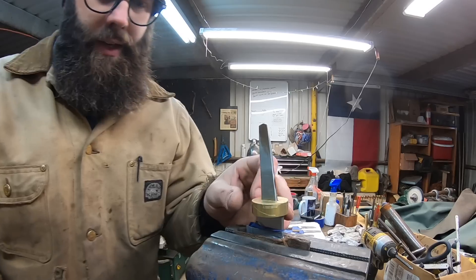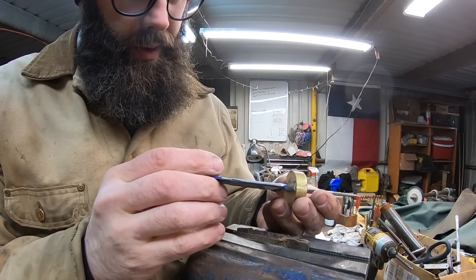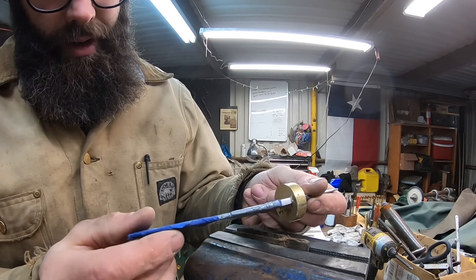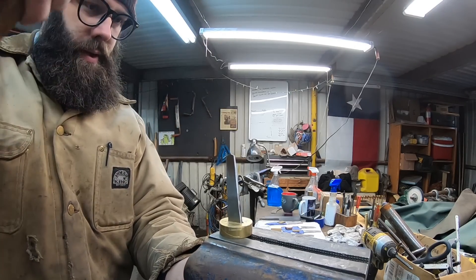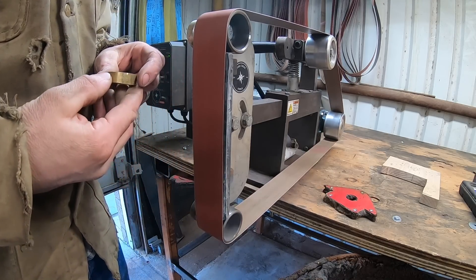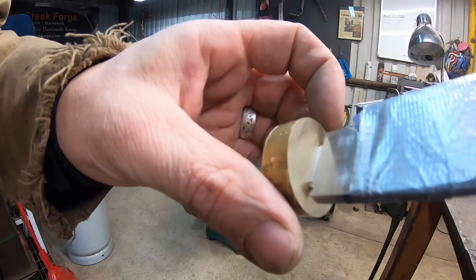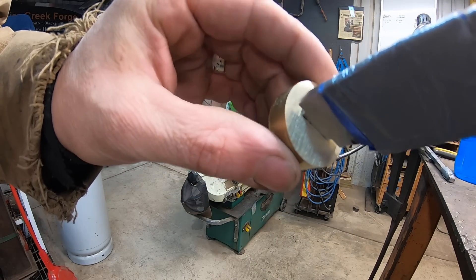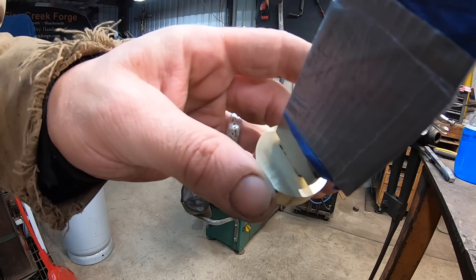The nice thing about brass as a bolster material is that if it comes in an annealed condition, it's pretty soft and moves around fairly easily. Now I can see where I need to actually take material off to snug it right up to the shoulders. I've gone ahead and cleaned up the face of this bolster on a 120-grit belt, but I've got a little bit of an issue — a gap where I drilled that hole, and since I filed too far on the other side, there's some gap there. It's a problem, but I'm going to show you how to fix that.